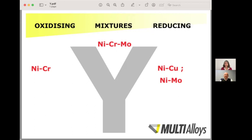That could be a bugbear when selecting materials in the first place, whether stainless steels, nickel alloys, or whatever they may be. Just to expand this point, we know there is a correlation, which we mentioned last week, between the chromium, molybdenum, and nitrogen in an alloy and its level of pitting or crevice corrosion resistance. This may be linked to these elements by the formula: chromium plus 3.3 times the percentage of molybdenum plus 16 times the percentage of nitrogen. This is a commonly used formula for stainless steels. The one for nickel alloys might be slightly different. But ultimately, the highest value from the duplex stainless steels we spoke about last week is about 45.